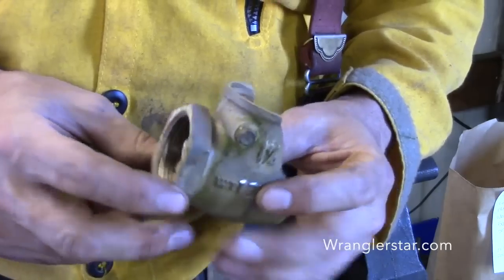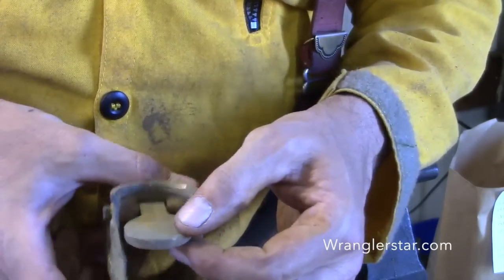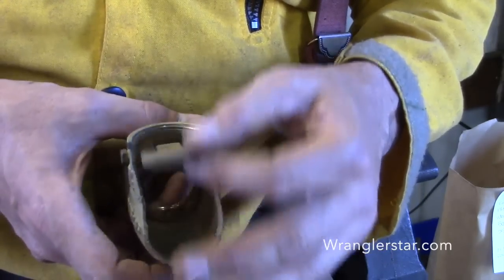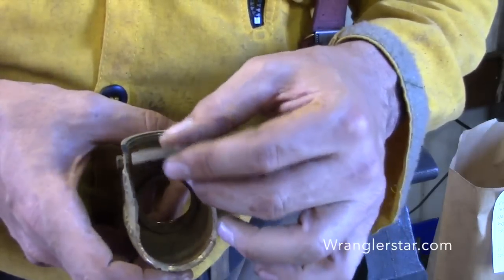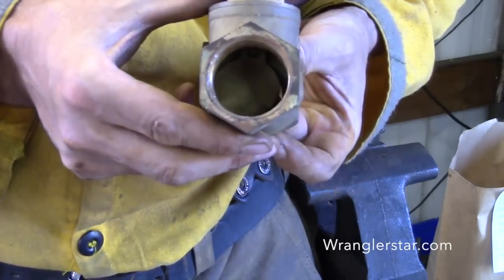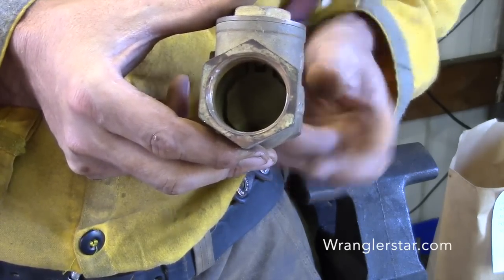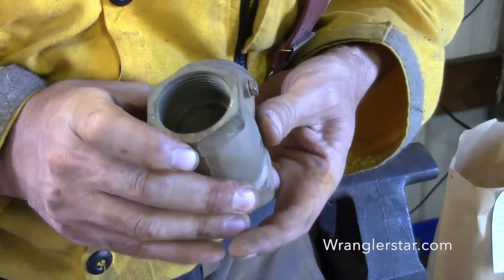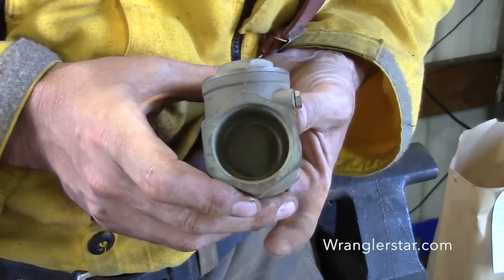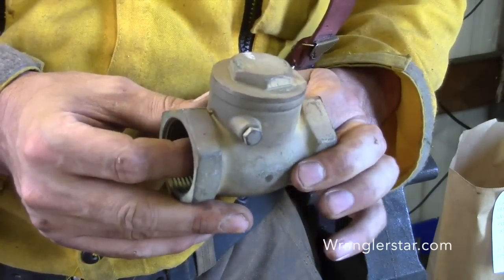I was looking at these and they look rebuildable — there's a little nut that holds the pin. What happens is they click away 24 hours a day on the ram pump, and this brass pin in here wears out. They get so sloppy that they will no longer seal. If you look at this old one that ran all last year, see how far that gate swings back and forth? It's so worn that it can close but water can still get past it. It'll still work, just not efficiently.